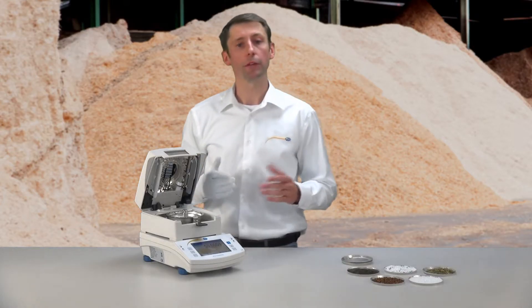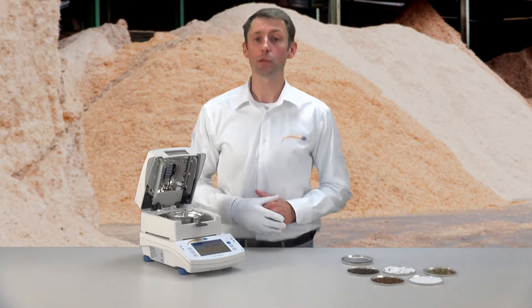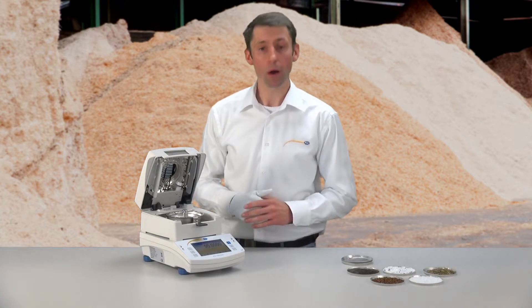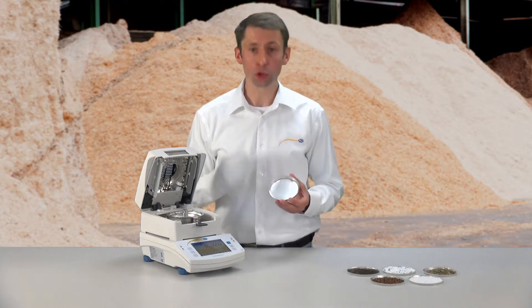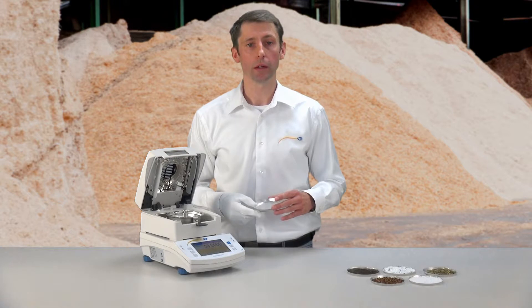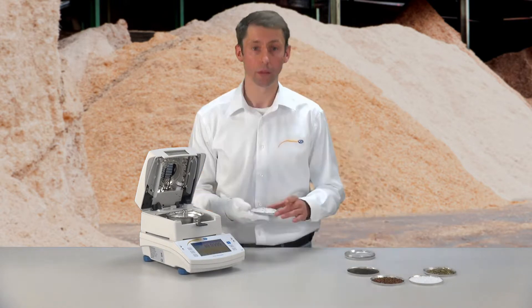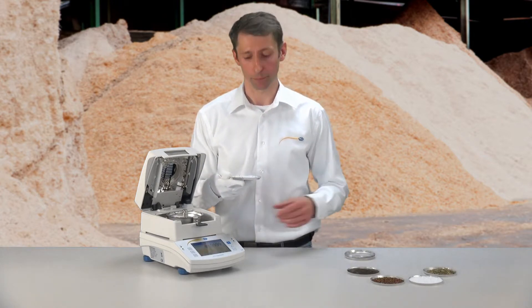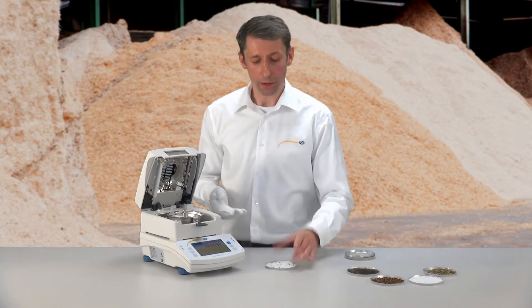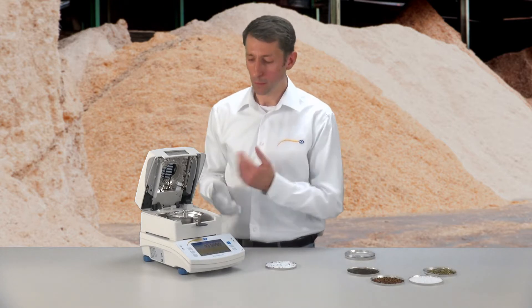The maximum weighing area of this built-in analyzing scale is 50 g. In humidity-determination mode you can theoretically exploit this 50 g too, but practically the problem lies in the volume of the probes. The probe dish has a diameter of 90 mm and a height of around 8 mm, so probe samples are clearly under 50 g. This probe dish is full to the top and weighs around 30 g. If I used a probe mass of 50 g, my probe dish would overflow and make my probe chamber dirty.